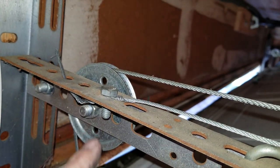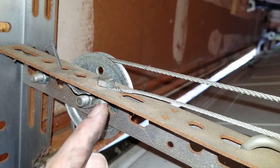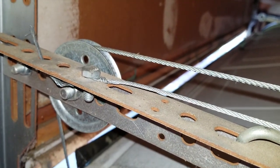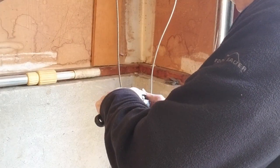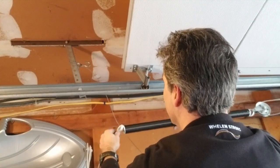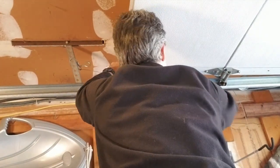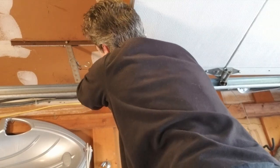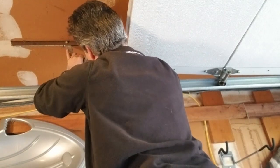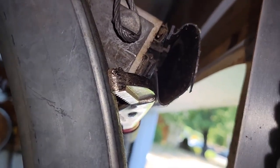This safety cable was actually anchored over here but was looped at the other end, so I had to disconnect it by unscrewing the bolt, pulling the cable out, and feeding it out. Here's where I demonstrated how not to use an adjustable wrench. I figured keeping the cable connected would make controlling the spring easier. Looking back on this footage, I'm thinking attaching the anchor side first and then running the cable might have been the easier way. After all, it's been 16 years since I last touched a garage door spring. Now I'll reattach the cable to the door.